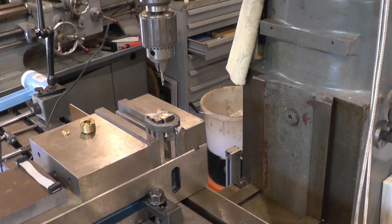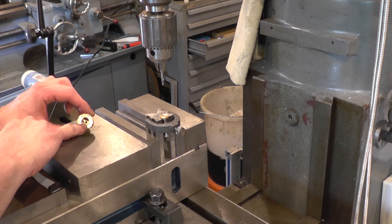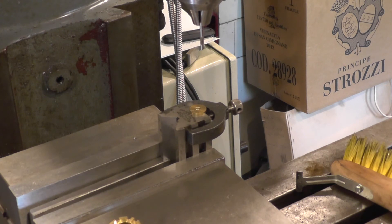As I say, this isn't hugely critical because the position of the hole — as long as it's not too close to the edge where it would be interfering with the valve seating, which isn't very wide — it should be fine. Okay, brought the camera around to the other side. I'll spot-drill this and then put the 1.6mm drill through.